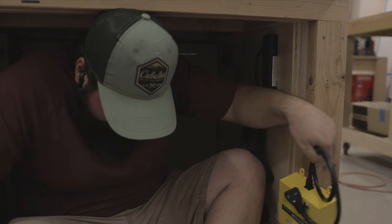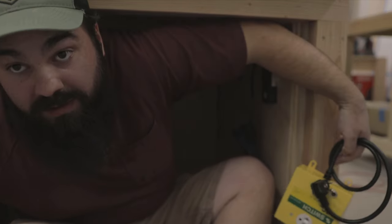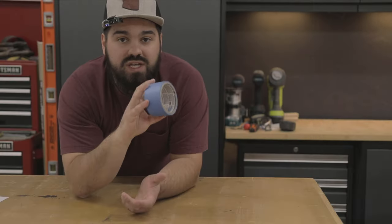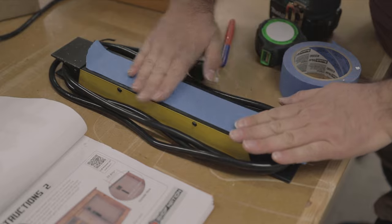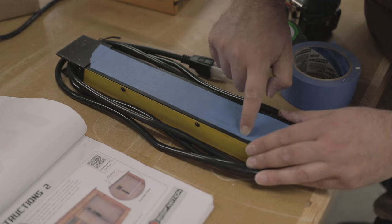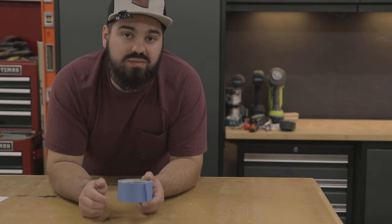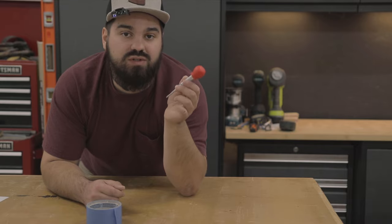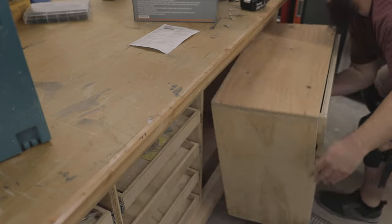The back of the power strip has keyholes on it. Take some painter's tape or masking tape and put a strip along the back side of the power strip. Massage the keyholes until they start to form a depression on the tape so you can clearly see the outline of them. Then mark the center hole using a marker and stick the template onto the inside of your workbench. I used a center hole punch to mark the screw locations so I could remove the tape before installing the strip. I should have waited to install the sander and track saw cubby — after nearly half an hour of messing around trying to get the dust collection hose onto the blast gate, I ended up taking it out anyway. Do better than me.